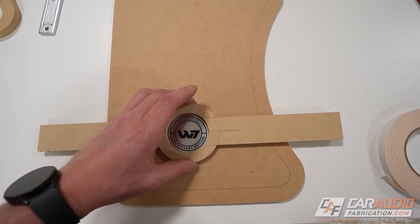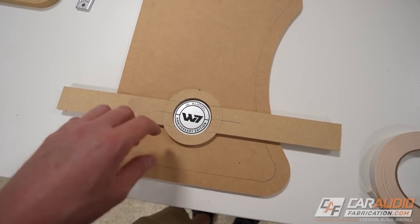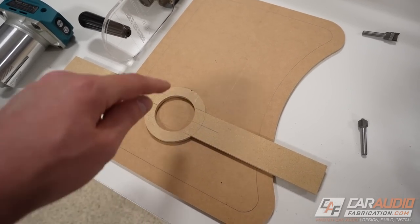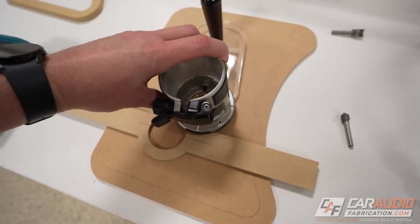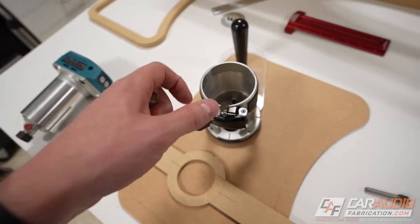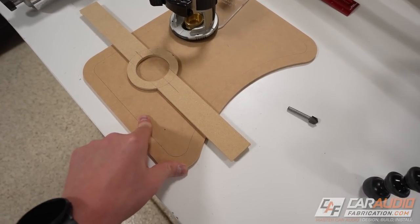Now that I've made this part, I need to determine where I want this logo to be. We could have it centered, or up here, but I think I want to use the rule of thirds and have it offset to the bottom. I'm going to measure off of this line to make sure everything is completely parallel, then stick it in place using some template tape. With it positioned exactly where I want it, I'll use my handheld router with an offset bushing to copy the outside of this profile using a flat V-nose bit. For the pocket for my emblem, I'll use a dado bit with a bearing to ride around the inside of the cutout hole and pocket out that spot. I've also used template tape to stick the workpiece to my table so it doesn't move.